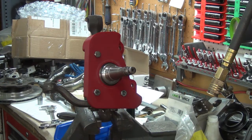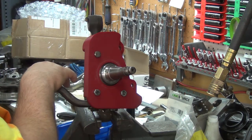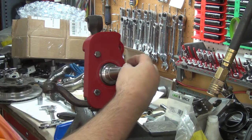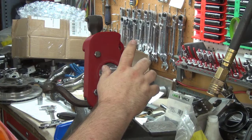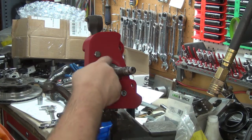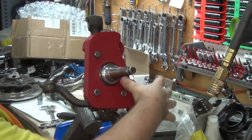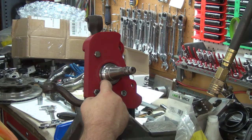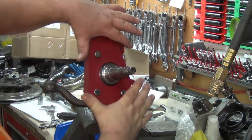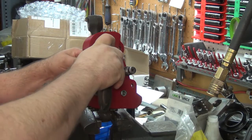I forgot to put the counterbore in there, and I knew about that. Okay, even though I had the nut tightened down tight, pretty good and snug, it didn't lock up. So I need to put the counterbore in there and then I think I'm golden. I put it in there but I always meant to go back and do a counterbore, that way I could keep even more metal in there. It's close enough — I don't need George to print another one to tell me that.